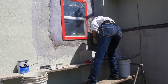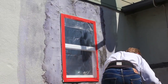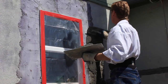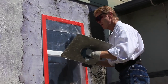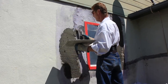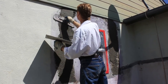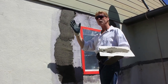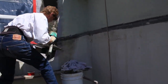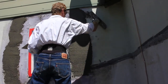We take a bucket of mud, a trowel, and we skim the perimeter first. What am I using? Portland cement. We give that perimeter a little bit extra, and we give this perimeter a little extra. Why do we do that? Because it's built up the most right there. Fortunately, this finish is very wavy — if you were to take it on the side you could see. For me, that means it's a very forgiving finish. The fellas who did the original didn't have a clue what they were doing, but they gave it their best shot. I know what I'm doing, so we've got to match it.